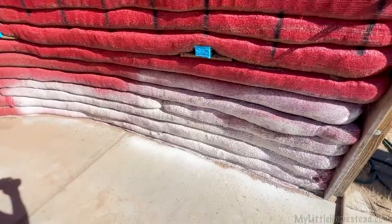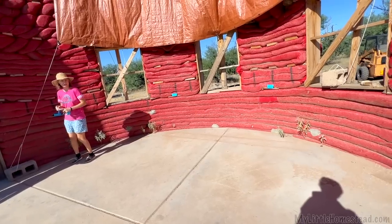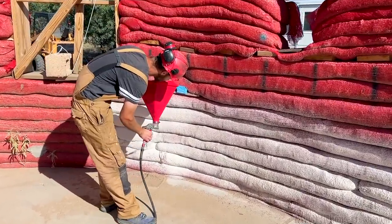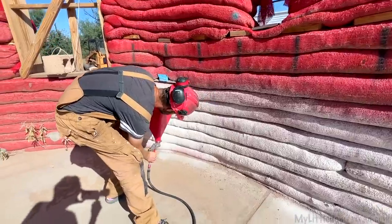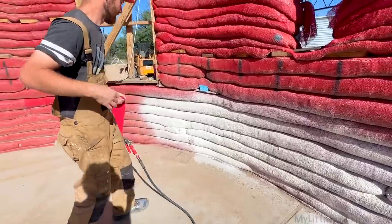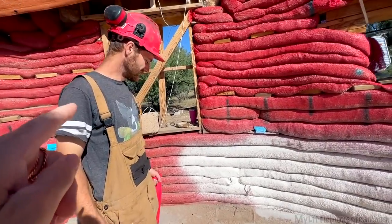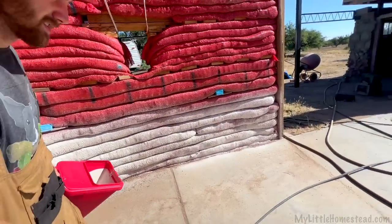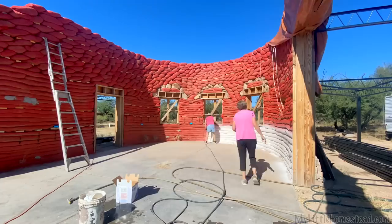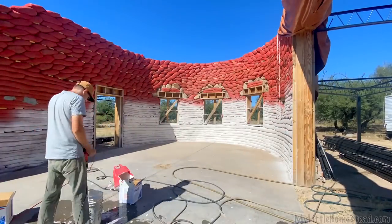It's nicer. You'd have to go over it a few times. What do you think, Bree? The thicker, don't you think? I think thicker too. Yeah, let's go thicker. Oh yeah, that's perfect. That's way nicer. So you went with the large nozzle and a pretty watered down paint. Think of it like paint. Okay, the consistency of this mud needs to be like thick paint to go through the hopper nicely.